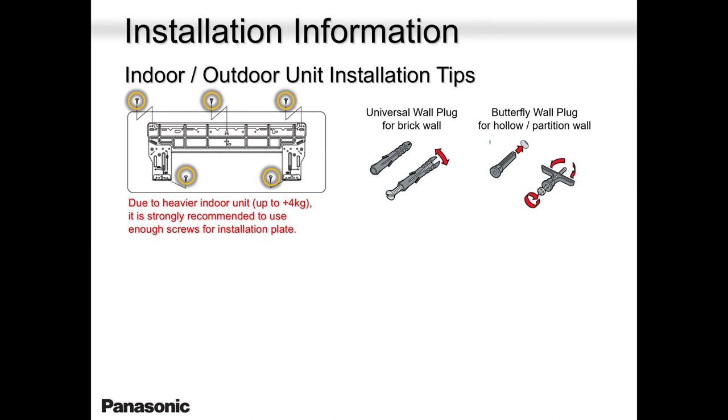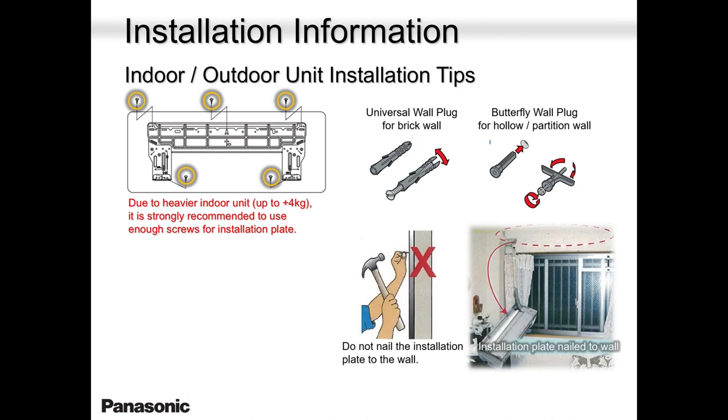The blower wheel is all over the map. We give them a new motor, after 6 months, they call us again. Same story. We go to the job site, we realize that the wall is not straight. In that case, you need to put a panel at the back, a nice straight square level panel, and then mount the unit on your panel. Those are only for cases where the drywall is wobbly. Nobody uses nails here, so don't worry about this part.